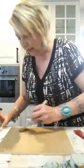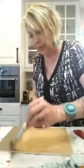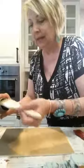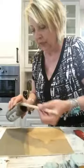And what's nice about the water-based wood stain, if you're putting it on bare wood, oh man, it works awesome. And if you're putting it on a piece that was previously finished, you want to make sure you sand it down before you use it, because the gel stain will penetrate, but the water-based stain won't penetrate through that finished sealed piece.